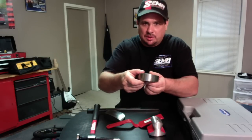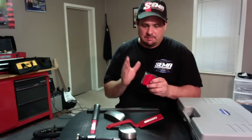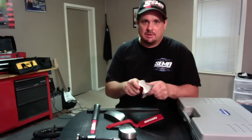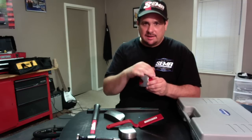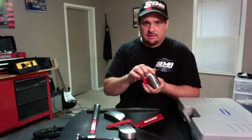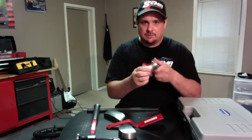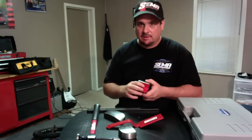Just make sure that whatever you're working on, you make this fit the fender. Now this has several different names. I think the correct name is Universal dolly. I've also referred to it as a combination dolly because it's got different types of surfaces going on. It's also referred to as a railroad dolly because it's kind of shaped like a railroad beam. This has a lot of different surfaces — you've got a real rounded radius here, an edge with a rounded surface here, and then a flatter radius here. These combination dollies are very handy and you'll find a lot of uses for them.